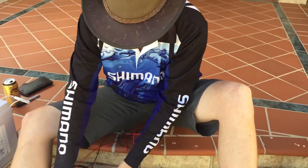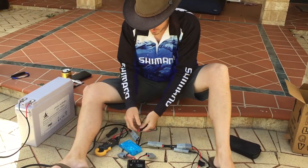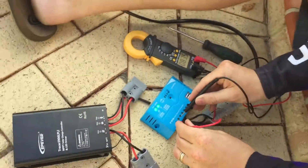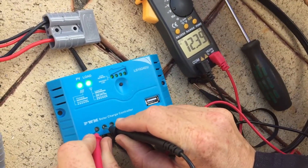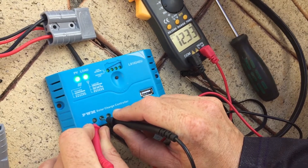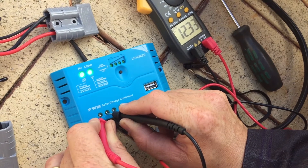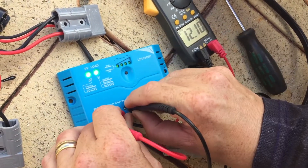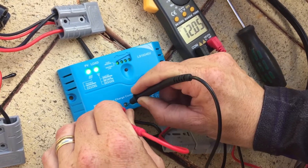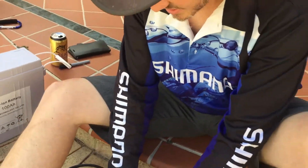The difference between the two is the voltage. Have a look at the voltage coming in — you've got about 12.4 volts. It's a bit cloudy at the moment so it's not putting out full voltage, but at 12.3 volts it's actually limiting the voltage — it's getting less volts on the other side. It maintains the amperage but the voltage can drop away.